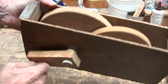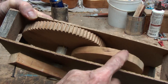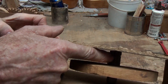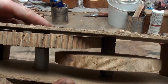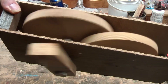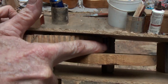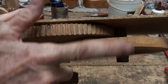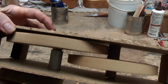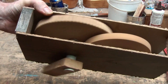As I got into making teeth and gears, I wanted to get more speed on my pulley end of things, so I decided to make a larger gear with a small gear of a broomstick handle. It definitely gets a better velocity, quite decent in fact, but with teeth being this small, the broom handle being across grain, the wood is not strong enough and the teeth tend to shear off. So while it worked, it's not a foolproof method.